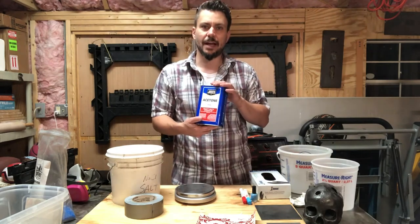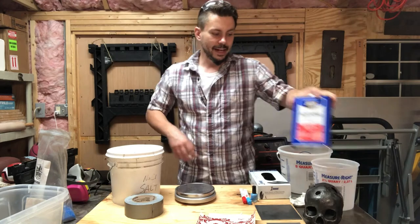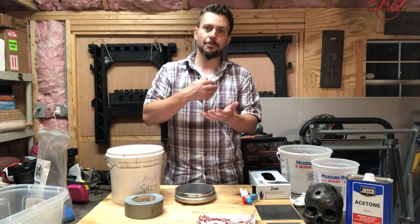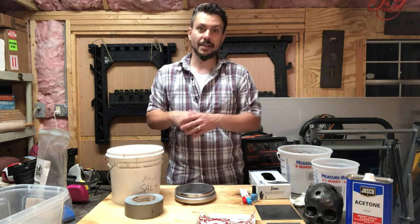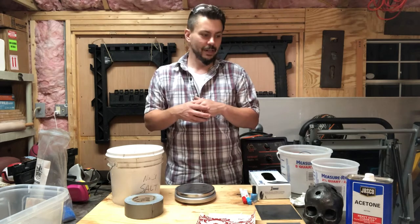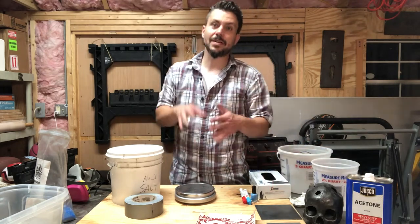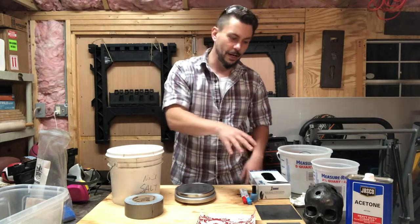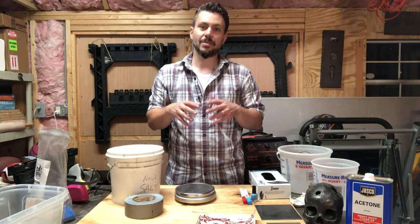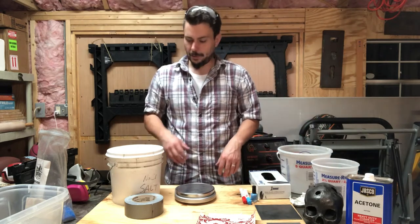Make sure you've got some sort of solvent — I like to use acetone because it evaporates very quickly. This solvent is what you use to clean the surfaces of your metal. The trick with this etching is that you want to choose the areas you want to stand up and out by creating a resist in whatever design or pattern you're using. Even touching the metal surface with your fingers and leaving a little oily residue can create enough of a resist to impede your etching process or leave blemishes in the design.